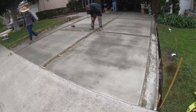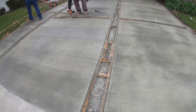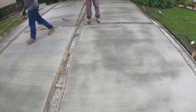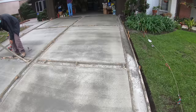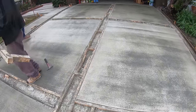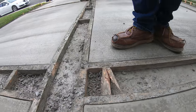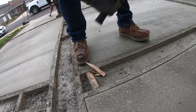Hi, David Odell here with Odell Complete Concrete. This is part three of the series. This is actually three days after the pour. You can see how that concrete is drying out fairly slowly — it's still pretty dark. When it's completely cured it's going to be all one color, a really light gray. All these forms you see in there are to allow for the inlay brick that's going to be going in — brick bands.